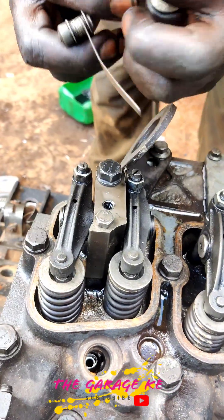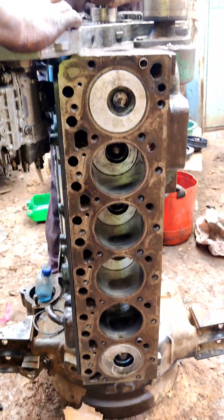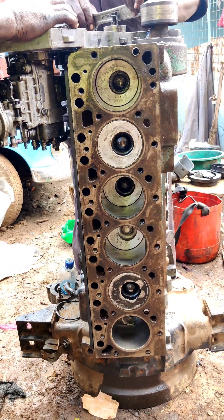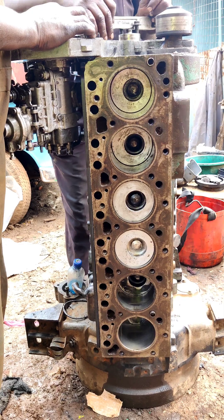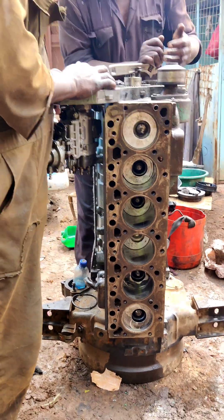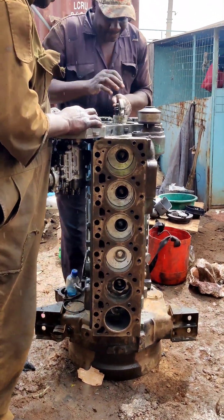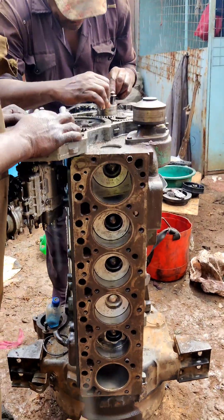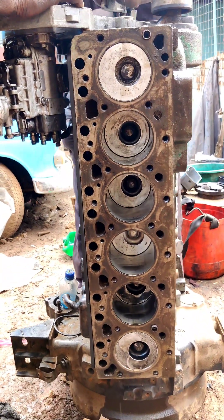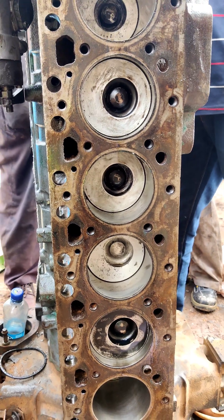The most common type of feeler gauge, called a straight-leaf or straight-blade gauge, consists of straight blades of uniform width constructed of high-carbon steel, sold in a set to cover specific dimensional values. However, there are variations on this standard. Within the blade variety, some variations include changes to blade length — long blade and short blade feeler gauges — as well as bent blade, also called offset, gauge sets. The bent blade gauge set can provide easier use in space-constrained applications and areas with restricted movement and access to the gap being measured.